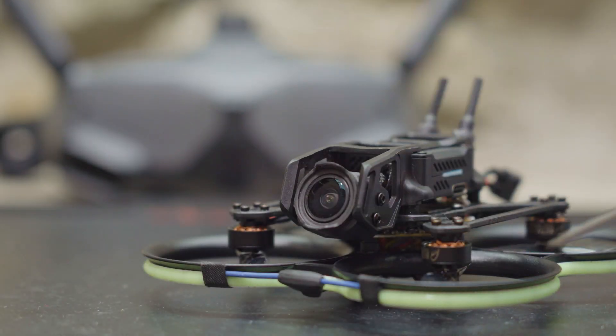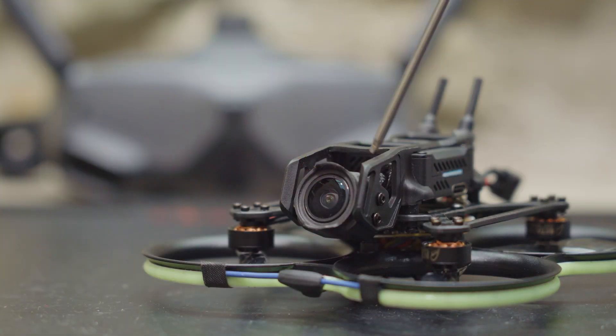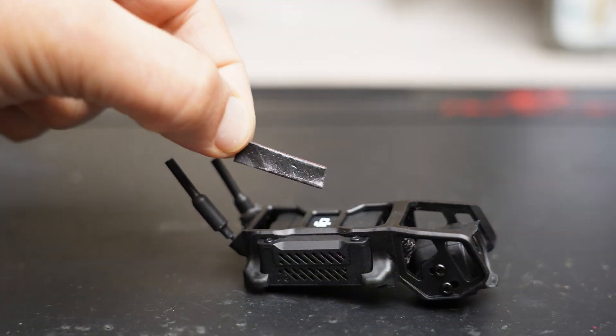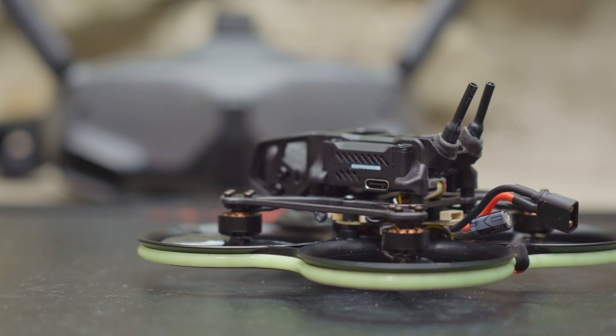Installing the DJI-03 air unit in the Pavo 20 is very easy — it wasn't a problem at all. BetaFPV has a basic installation video if you want to use it for reference. A few tips: unless you're using the DJI remote, you should remove those last two wires from the DJI wire harness. I used a zip tie on my camera cable to keep things clean and make sure it doesn't get near the props. My antennas were really loose in the plastic mount, so I solved that with small strips of VHB tape — I wrapped a thin strip around the antenna and worked it into the mount to provide enough sticky friction to keep them secure.